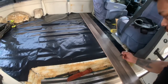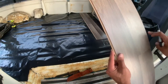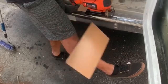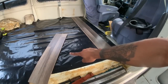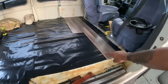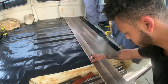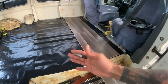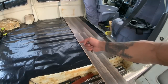Once your second piece is on, take your marker and mark where it ends, then take your saw and cut from that line all the way across. Take the piece you just cut and put it into place in the first row. The other shorter piece becomes the starter for the next row. Grab a fresh new piece, and repeat the same exact process — mark it, cut it, that cut piece becomes the starter, put a fresh one, and keep going all the way back. This way you don't have the same pattern repeating over and over, and eventually all the pieces connect together to hold each other.